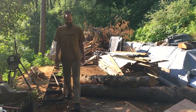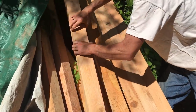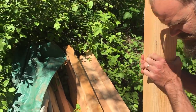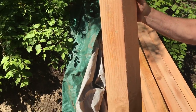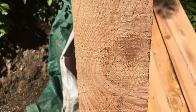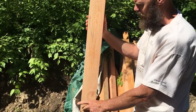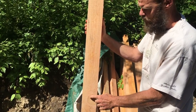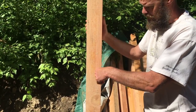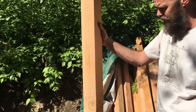Are you getting on the regular mill today? The reason for that is that while getting ready to set up the frame for our new workshop, he felt that some of the smaller timbers he had milled himself were not highest quality. So this has too much of that width interrupted by that knot. The problem with the knots is that it interrupts the linear structure of that beam.